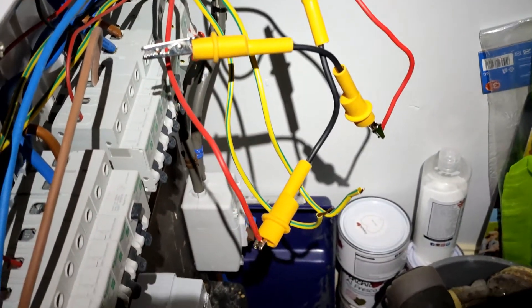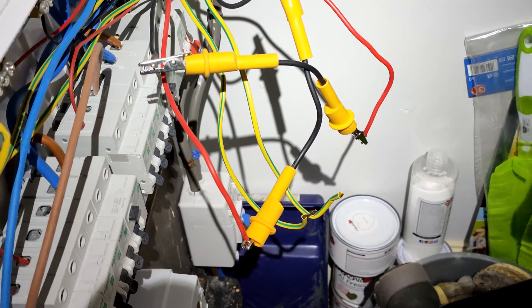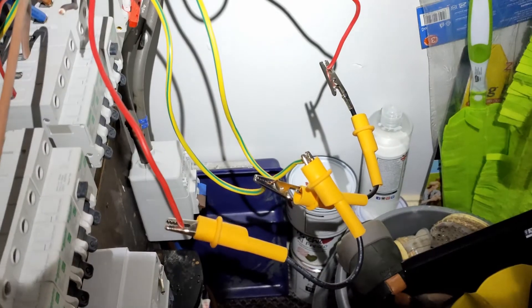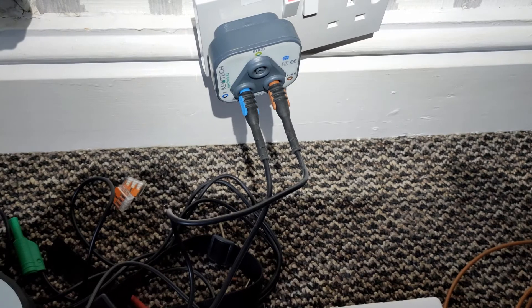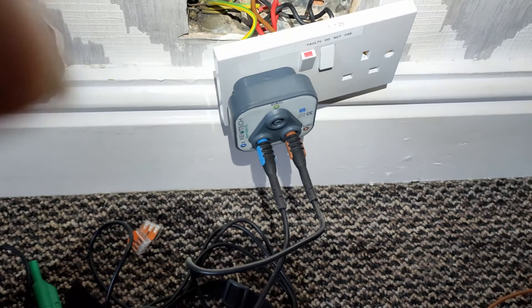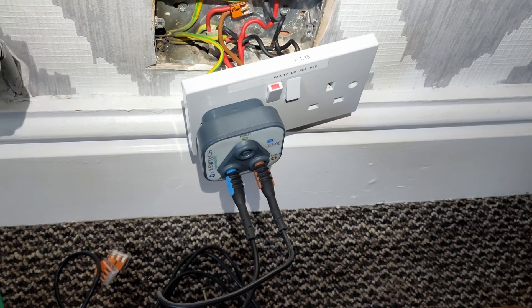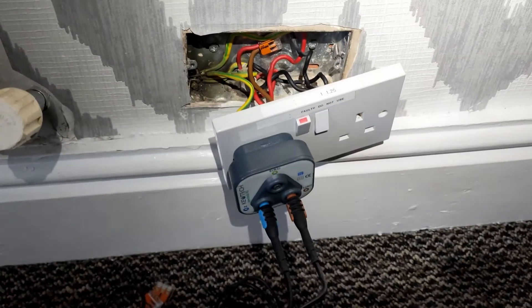Here are the cross-connects for doing the R1RN between the two cables. We'll swap those over to configure for R1 R2. I'll move the blue one over to the R2 port. This time it should be 0.4 plus 0.66, so we should be getting readings somewhere around 0.25, again plus or minus 0.05.